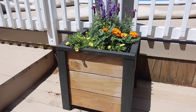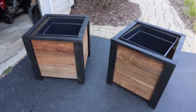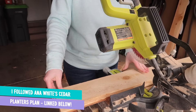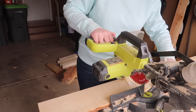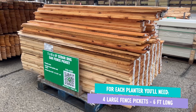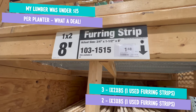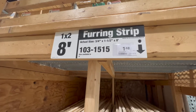Now we're going to hop into the vault for this one because I've gotten so many questions on these planters that I made last year. I wanted to share it again in case you missed it — these are so inexpensive and easy to make. I used Ana White's cedar planters plan and I made two of them — I'll link it down below. For each planter, you're going to need four large fence pickets at six feet long, three 1x2x8 furring strips, and two 1x3x8 furring strips. With the furring strips, all the lumber comes in under $15 to build one planter, so both come in under $30.